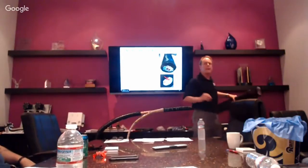So the point is, everything we send out is touching a glycol line. Filament tape to it, barrier tube tape. That's the name of the game. You can't go a couple of feet without contact, without creating some hot spots. And if it gets hot, it releases the CO2. CO2 doesn't go back in because it's touching cold again down the road. It's out, it's staying out.